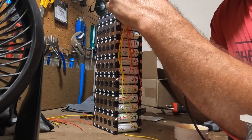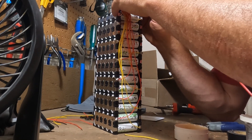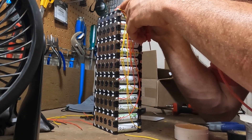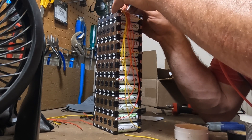I'm going to stick that pin right down there onto that battery negative, and then we're going to go through individually through each pin and make sure we're getting 3.6 volts, 7.2, 10.8, 14.4, and so on.